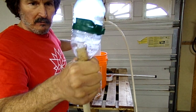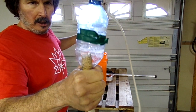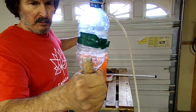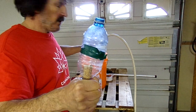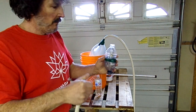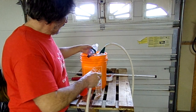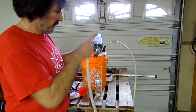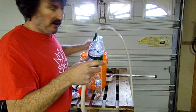That's how the valve is going to work. And you just put that in line and keep it upright. And we're going to put another valve in here so you don't have to worry about the water flowing back. We'll run that one upside down, in like so. So essentially it will suck in and then pump out, so you won't have to break the vacuum every time.